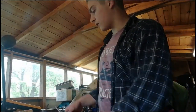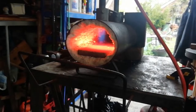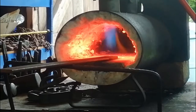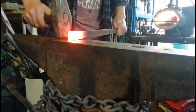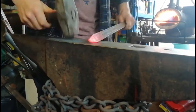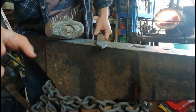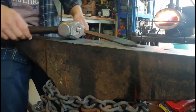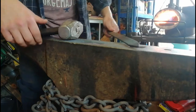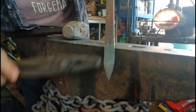It is one inch by about an eighth of an inch rectangular stock. All we're going to do is place it in between the ends and create some depressions — about one or two on the back plate — and obviously it will hook over. We're going to use our new fullering tool and create fullers around about here and here, a couple of fullers, and we'll put the end hole in the middle.